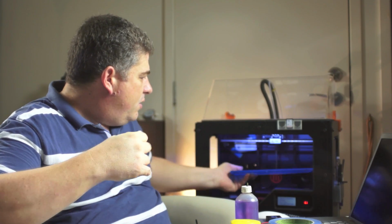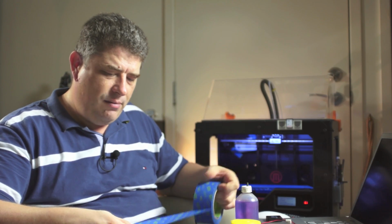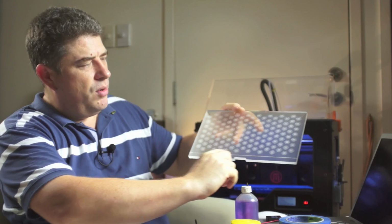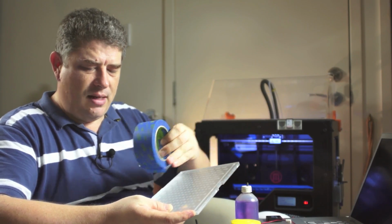It's kind of like the same process, really. I'll show you on the other board because it doesn't have any tape on it, and that one I've already done. But basically, you're going to pull off sheets. I do the whole thing, starting at the back. On the MakerBot build plate, it's got a line pretty much on the top and the bottom. You can see them there. And what you want to do is, on the other side, line up the tape edge along the line on the back there, and then just work your way forward with the 3 layers. So this is 50mm wide tape, so it does three layers to get 150mm across there.